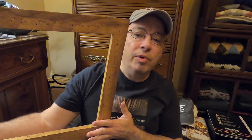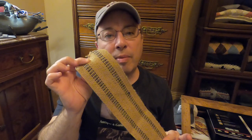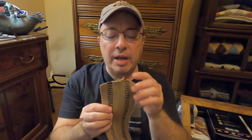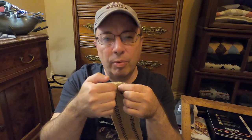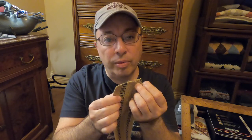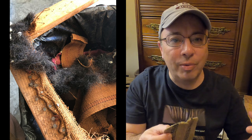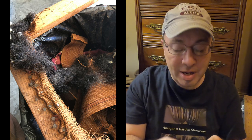So today we're going to take that old seat frame and replace the three-and-a-half inch webbing on it. We're going to criss-cross the seat. The original webbing had carpet tacks, and one thing I did not like about that is they pulled through the woven material. When the center of the chair was taken apart it was all horsehair stuffing, and that horsehair was full of tacks — so anyone who sat down probably got quite a surprise. To prevent that, I'm going to use staples instead of carpet tacks.